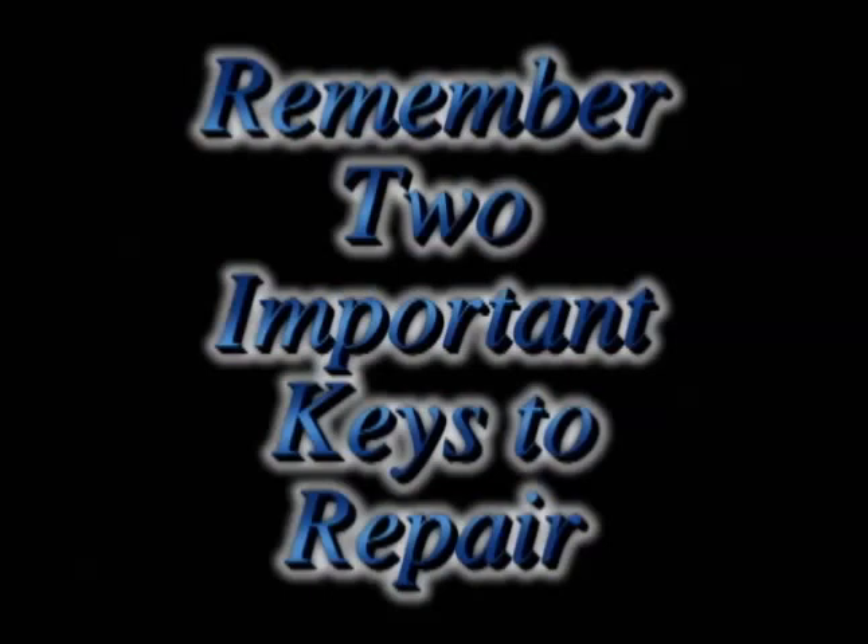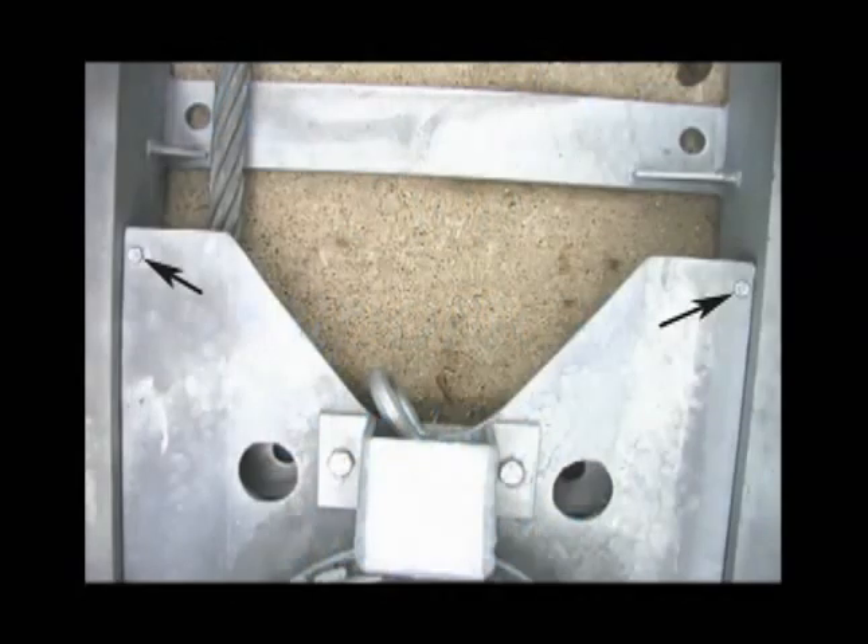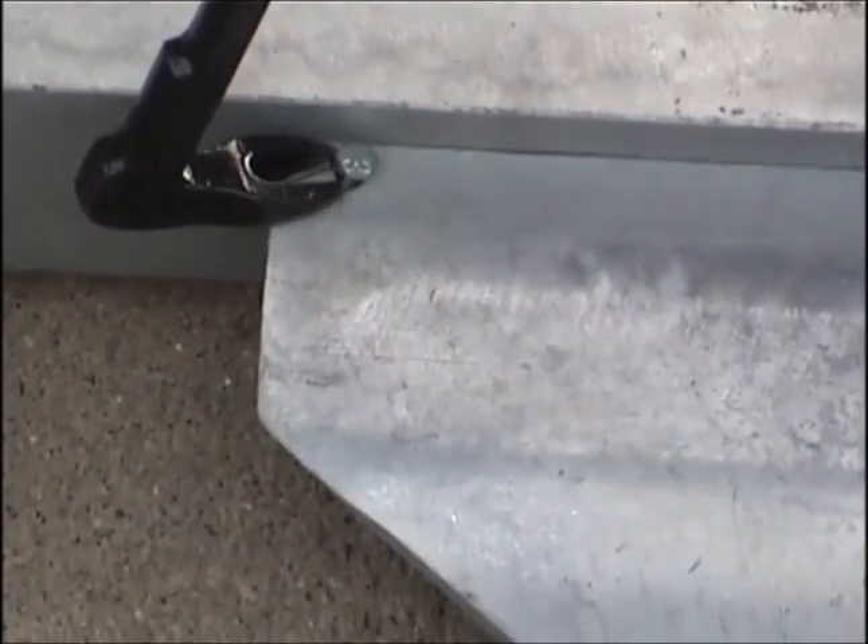The SCI 100 GM can be reset very quickly by industry standards by making sure that you know a couple of important facts. First, we have two shear bolts in the mobile sheave assembly at the front of the cylinder. After these bolts get sheared off, the remnants must be removed before you try to pull the cylinder and sheaves out. A ripping bar works well for this procedure.